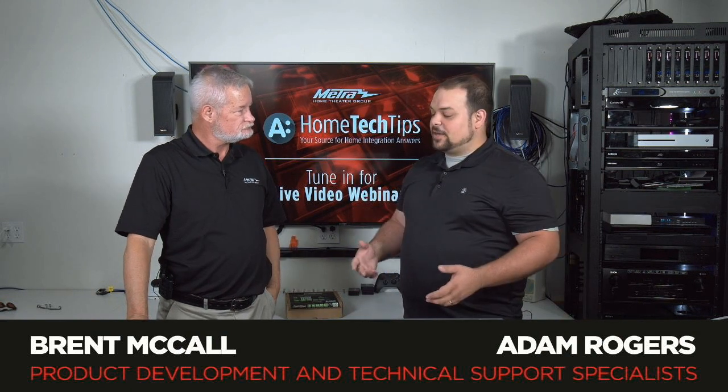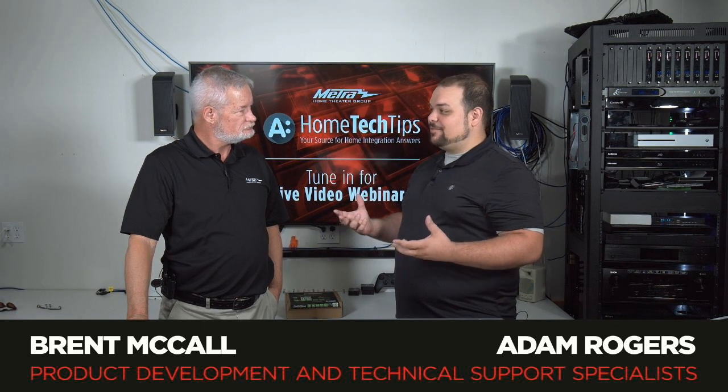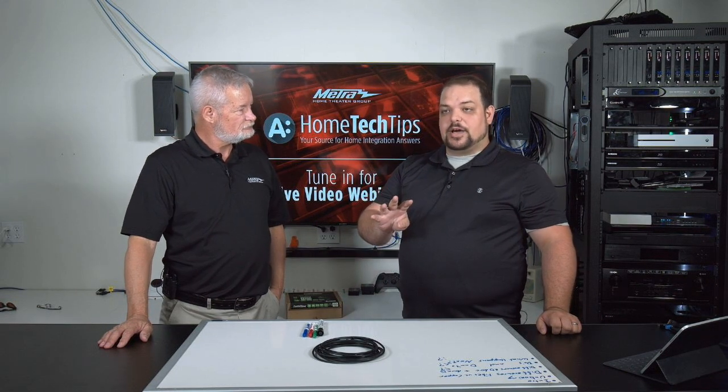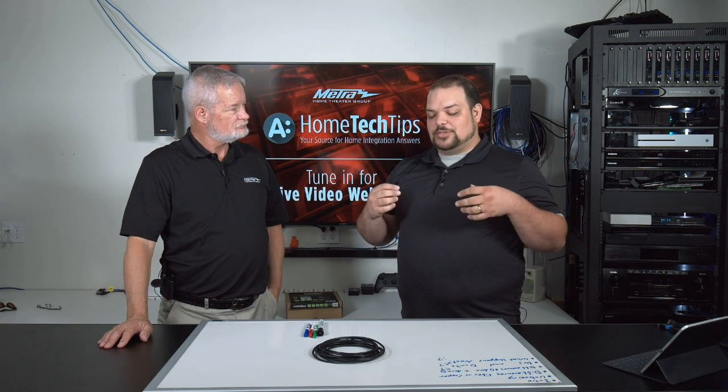So today we're going to be talking about HDMI AOC cables, which is really exciting because we're doing fiber instead of copper. Explain AOC. So we've got our 4 channels inside of our regular HDMI cables. In a copper setup, over longer distances you are going to have EM radiation from other things in the area, power lines, other signals, things like that, that can cause issues on that cable. So with fiber, the biggest difference is that we're using light instead of electricity, so we don't have that problem. That's one of the biggest benefits to it.